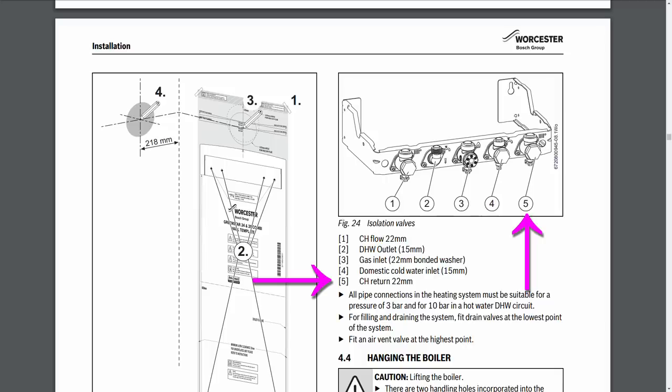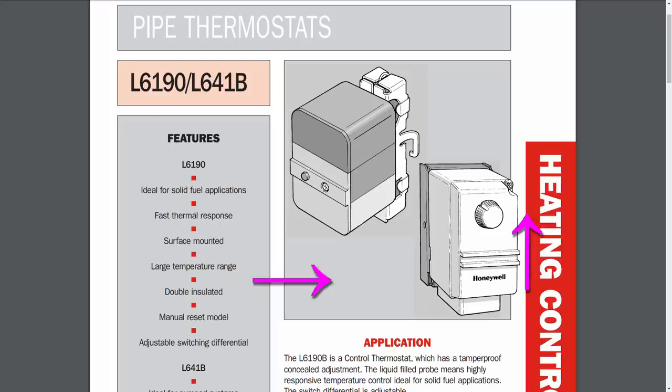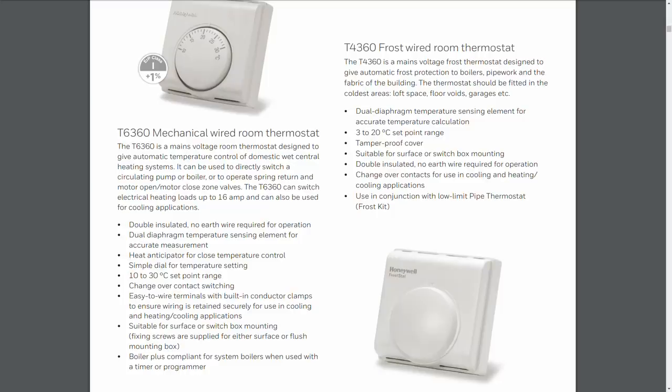And the idea of that is that you want the heating to turn on and heat up all of the pipes, so you want to be sensing on the one that comes back to the boiler, because by the time that one has heated up, that means all of the other pipes in the building would have also been heated up as well. If you put it on the flow one, then it would pretty much turn off as soon as the boiler switched on, because hot water would flow out, all the pipes heated up and that's it, and you'd only end up heating just a few feet of pipe. Of course, that wouldn't really achieve anything. So on the return pipe for the boiler, and the wall-mounted one goes wherever the cooler part of the house is going to be.